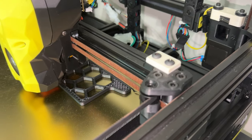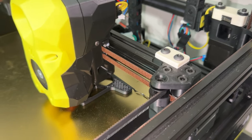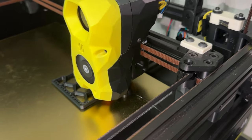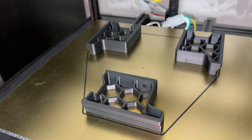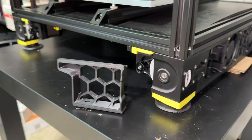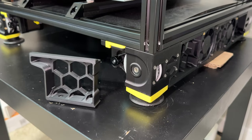The prints seem to take forever. For cosmetic pieces, slicer settings can be adjusted since they don't require strength. Try reducing the infill to 25% and use a less complex pattern such as grid. Top and bottom layers can be reduced to 3.